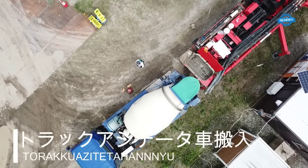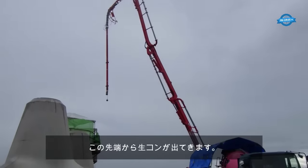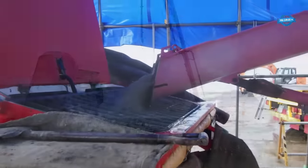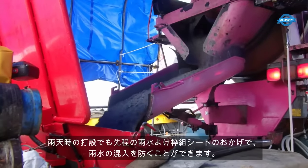Pouring concrete mix. Once the shape-forming pieces are assembled, a concrete mix is prepared according to the required specifications. The concrete mix is typically a combination of cement, aggregates, such as sand and gravel, water, and sometimes additives. The mix is carefully poured into the mold formed by the shape-forming pieces.